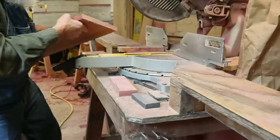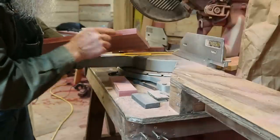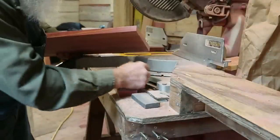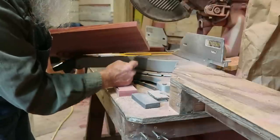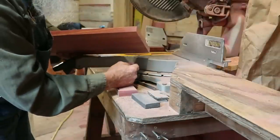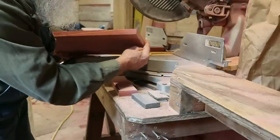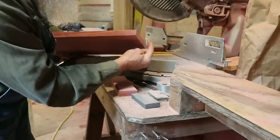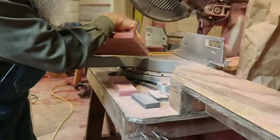Now I can see that tiny bevel. It may be difficult to see on the camera, but there's a little bit of a bevel from this point here to right here, so that when I put my little trim pieces underneath the treads and go up through the side of the stringers, hopefully it'll be a nice clean fit at this point right here that you'll actually visually see.